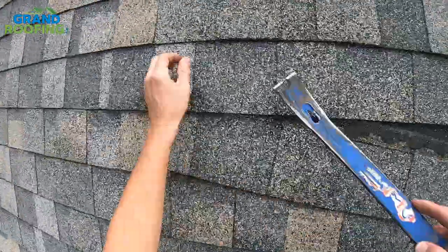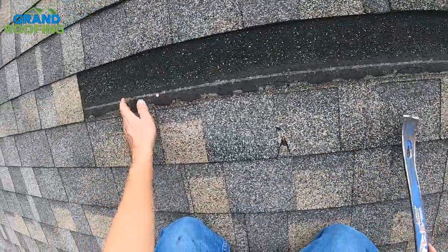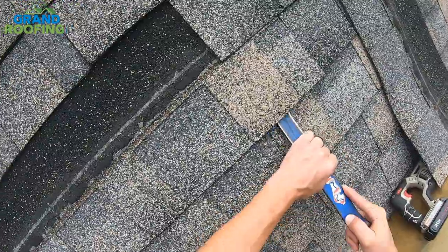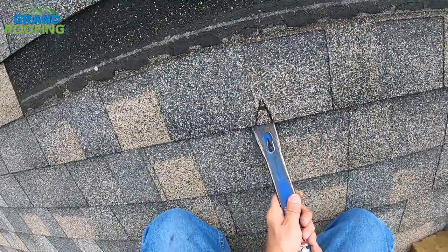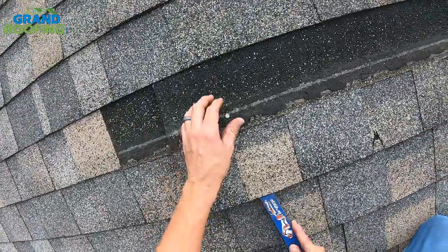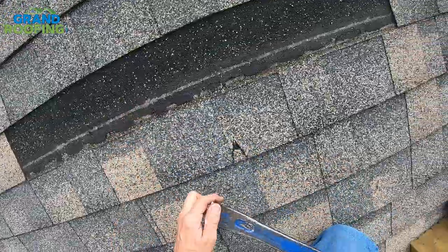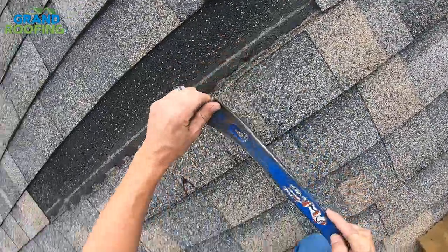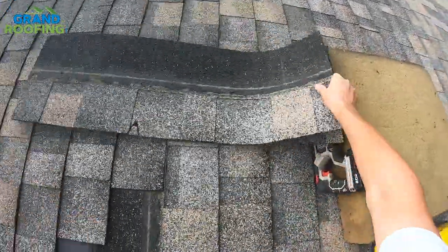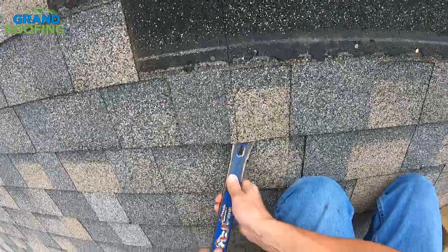Getting started right here. This nail should be over here — it's only a four-nail pattern. I believe this roof is fairly new. Manufacturers say four is okay, but a box of nails is cheap insurance. Let's use a couple of extra nails, properly spaced. He has new shingles so we're probably going to use the new shingles. If you're careful and you don't damage these, you're probably okay to reuse them. But if you've got new ones with good seal strips, just use the new ones.